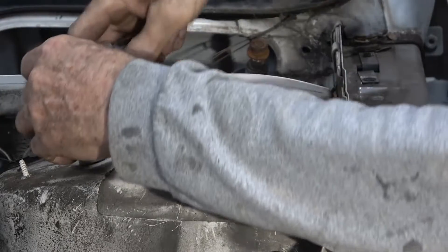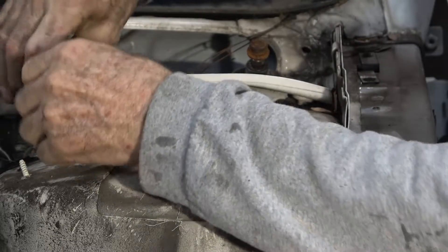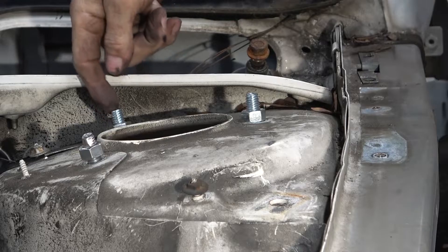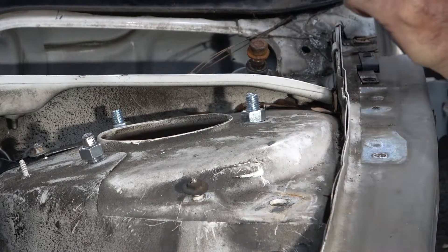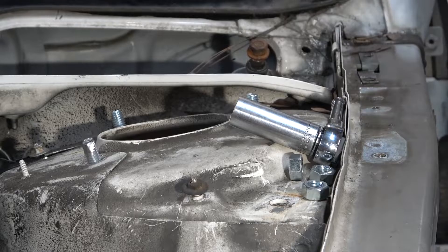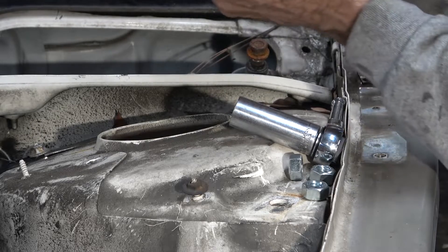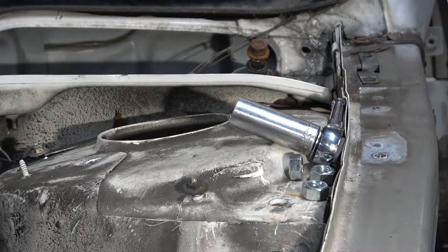Now that I've got these welded, I can remove them. You'll notice the edge of these bolts here — and you can't see the back side of this one — but they're ground because the top of this is curved, which makes the bolts lay out that way. I'm not sure if I've ground these enough, but it should drop right out. And it did. There I have the top plate that'll hold my strut plate in place once I build the jig.